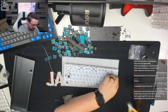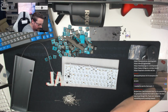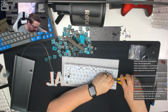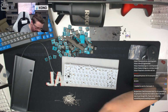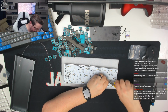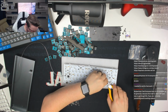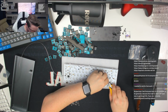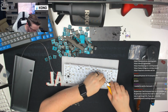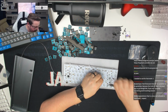And then again, you can just flush cut these off. These tend not to be as neat because we've had to bend the pins, so it's sometimes easier to see an issue with them. We may have a small issue with that one. We may have just pulled a trace out, so we'll have a look at that in a minute. If we have, it's a relatively easy fix.